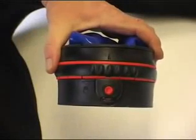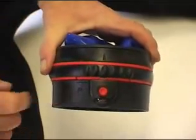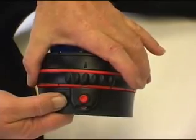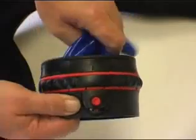To unlock the glove from the main body, place the locking mechanism at the top, as we have done here, and place your hand so that you can grip at 3 o'clock and 9 o'clock. Then turn the ring anti-clockwise, which will unlock the glove, which can then be disengaged from the body.